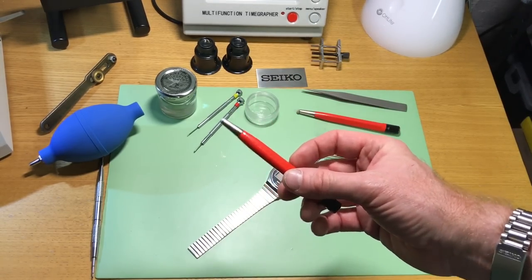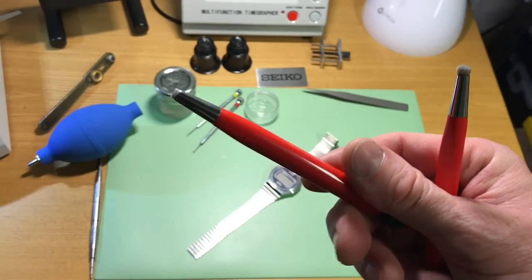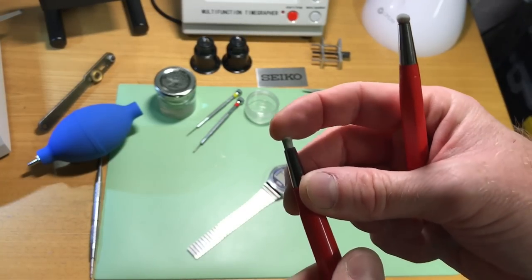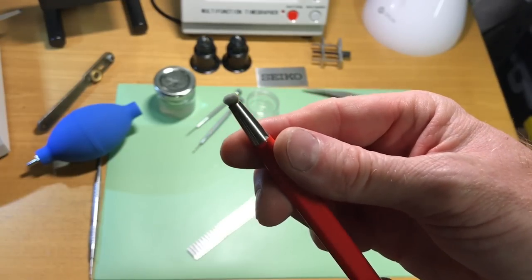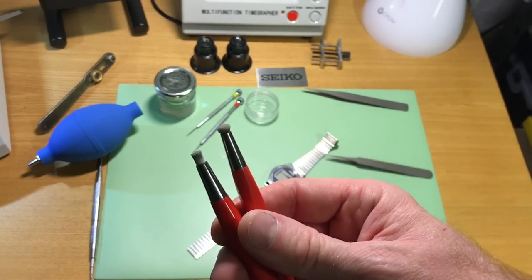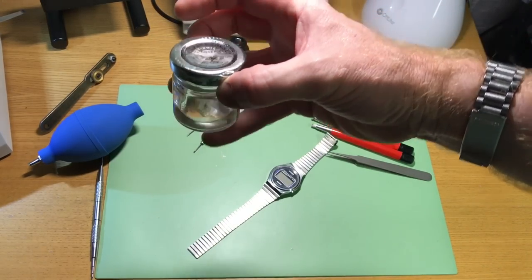A fiberglass brush. Now, these are really, really cheap. You can buy them on eBay, a couple of UK pounds, a few dollars. And you can twist them, and it's made out of fiberglass. This one is unused hardly, so it's quite hard. Whereas this one I've used a lot, and it's nice and soft. So I kind of use them now in combination. Very good for cleaning the boards. It's a light abrasive. To use with that, I use alcohol.